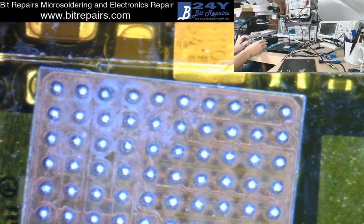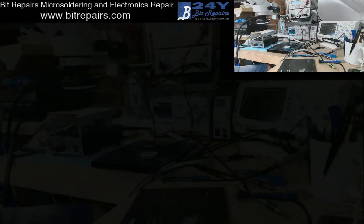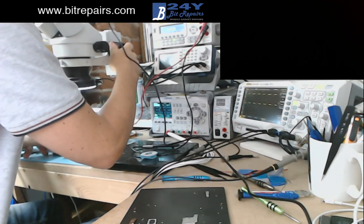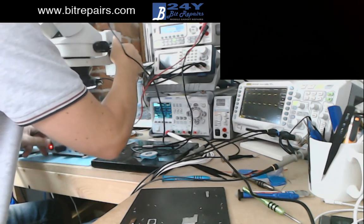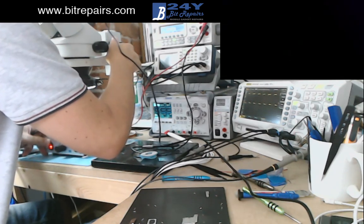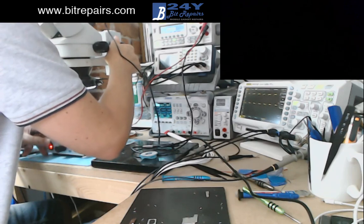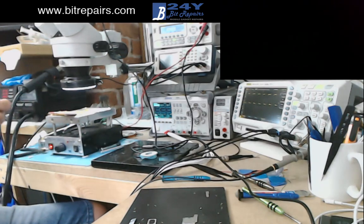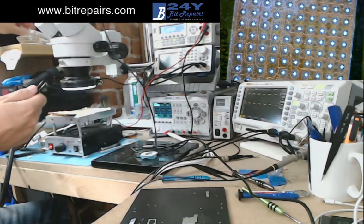That's passable. What I'm going to do now before it goes on is look around the perimeter of it - the tiny little wires going all the way around the outside of this. If any of them have been damaged when they've been trying to re-ball it, then the IC is not going to work. To me that looks okay - that's a good candidate.